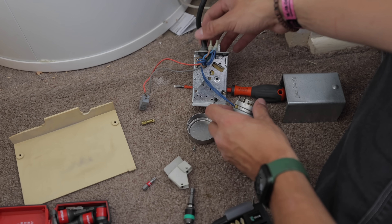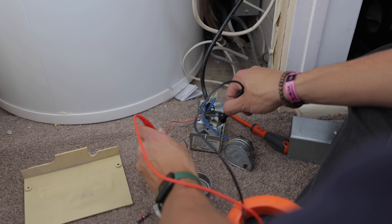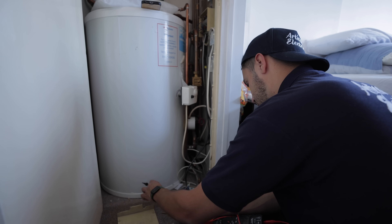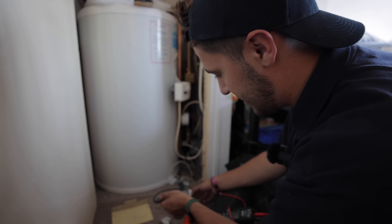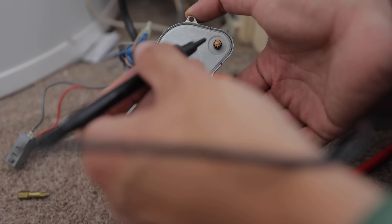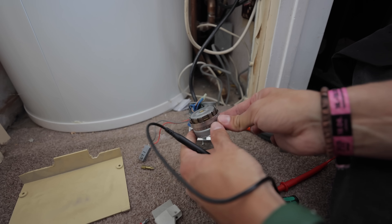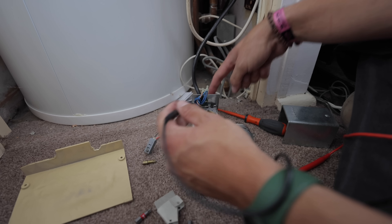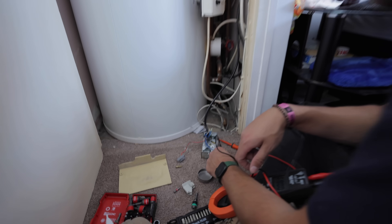We can test this switch — turn the power back on. Now we have to be careful not to get belts off of all this stuff. Let's see if anything's live just now. 240 volts there, nothing on that side. The bridge is working fine. So I'm not worried about this little micro switch, but this motor doesn't seem to be doing anything at all. Always touch it at the back of your hand when doing sketchy work. When doing sketchy work, always act sketchy — just flick it with the back of my finger before I touch it. So you want to be seeing that spinning like that. That's what you want to be hearing. It feels pretty free, it's just not moving. And all this spring mechanism is doing is just resetting it, then it comes and touches that little limit switch there.